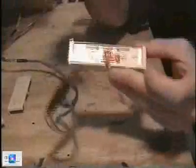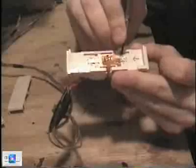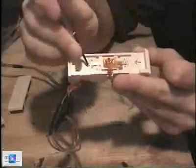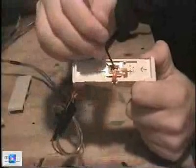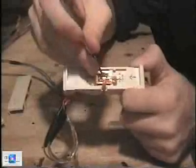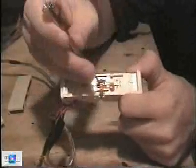The interesting thing to note, which someone on the Stripe Snoop developer mailing list pointed out, is that the V3A family has these little screw holes right here. These screw holes are there because Omron just built the same plastic casing regardless of what reader it is, and all it does is align it differently. If you have a read head that can read two tracks at once, that just means there's a wire for ground and two wires for the magnetic sensing.